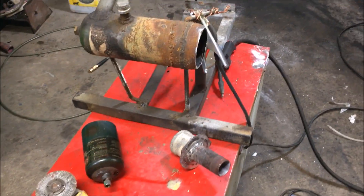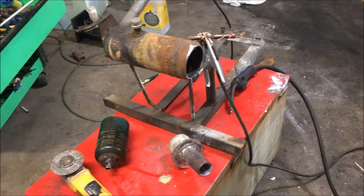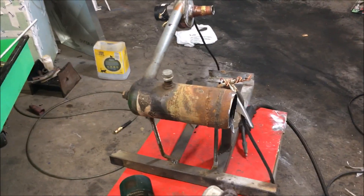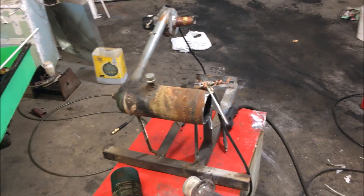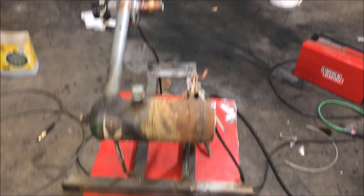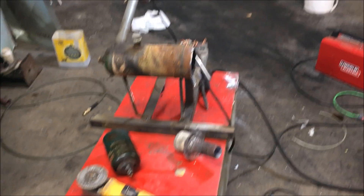The flash point of synthetic oil is so high — if you're not using synthetic you don't have to worry about a lot of stuff. If you're having troubles and your waste oil burner just isn't lighting and isn't burning right, it's most likely because you're using synthetic oil. You just need to add a small amount of gas to it. Even actual machines designed specifically to burn waste oil will not run on pure synthetic — that's a hidden piece of information that's very hard to come across. It took me months of messing with these things to learn that.